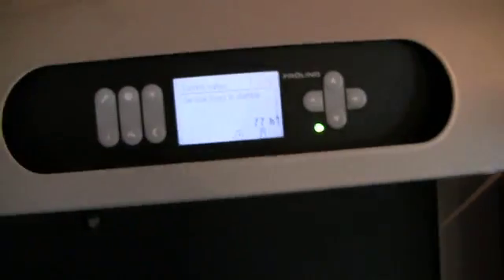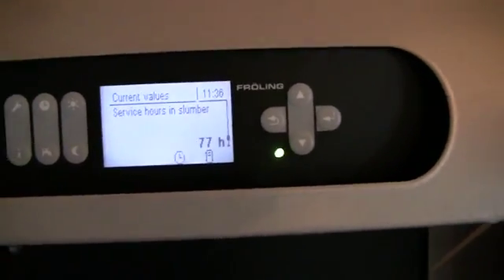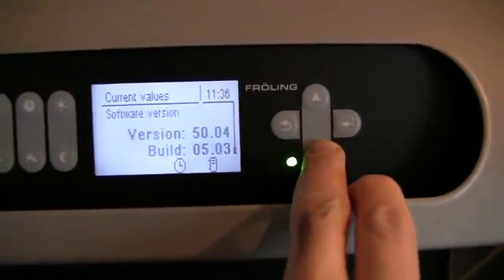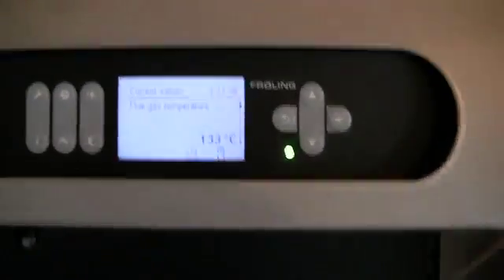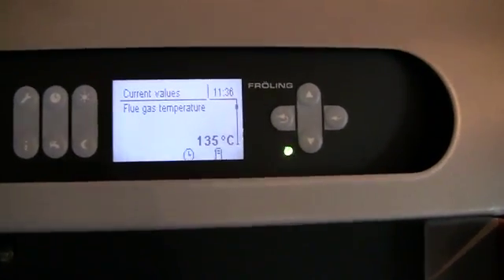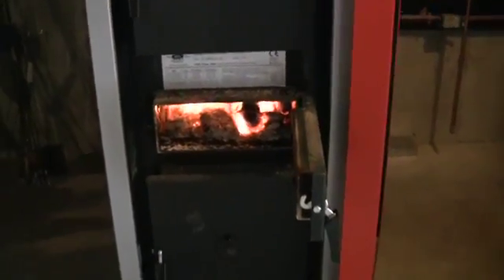Service hours in slumber: 77 — that's a little high, but that shows the times when it was firing and had to close those dampers way down and idle the fan because the boiler was getting too hot or we didn't need the extra heat. It's got all kinds of safety mechanisms built in as well. They say you can close the door at 135 Celsius flue gas temp, but I'm going to let this get up to about 170 or so — it tends to burn a little better in my experience. When I'm ready, I'll close the loading door and shut the main red door, and that'll be a burn. Thanks for watching — Froling Wood Boiler Ignition. Let me know if you have any questions.